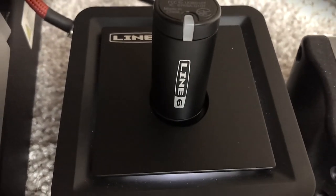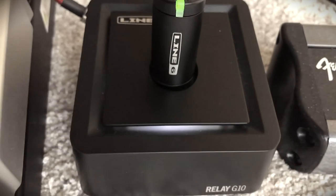One thing I'm aware of now, after using wireless guitar systems, is the connection volume. When the note dies on the guitar, you want to be able to hear it until there's no sound at all. Some budget wireless systems will almost gate the note when it reaches a certain low volume — almost like the system is saying it doesn't detect a sound anymore at a certain threshold, so it won't transmit it — whereas the G10 doesn't do this. This is just my experience, as I play at low levels in my apartment.